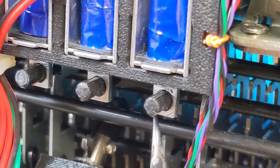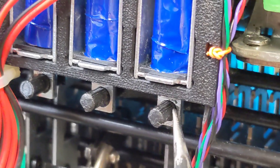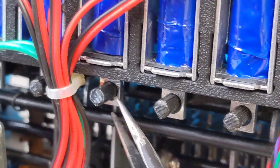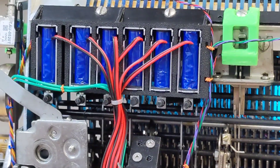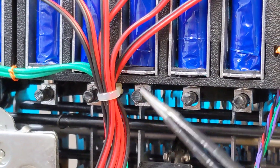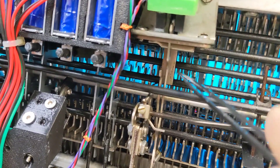I was a little curious about these things — it's metal on a plastic peg. If you look really closely there is a sort of a polished area around these pegs, and right here that's a little bit of plastic that's worn off. When I was messing with it I actually broke this one — it broke right back here where the peg goes from straight to where it angles over. I had to pull off this whole thing and reprint that one piece, which was a difficult thing to find the right file for. But I did find it, reprinted it, and stuck it back on. When I pulled it off I noticed the CA glue holding the printed piece to the lever wasn't exactly the strongest joint.